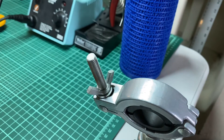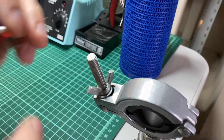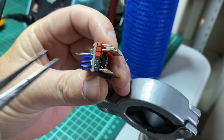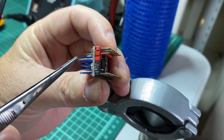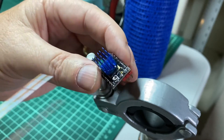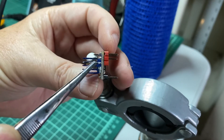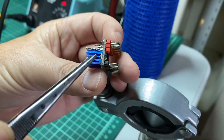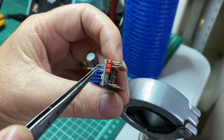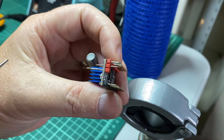When you're done soldering, it'll look like this — you can see there's no pin here and I've pulled the pin out so it's sitting really high. It's about the same height as the heat sink, so it won't collide with anything. I like doing it this way because later, if I ever want to use sensorless homing — probably not — but I could just heat it up and push it back in.